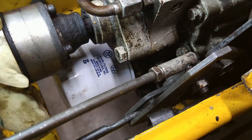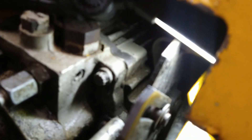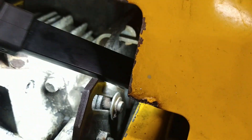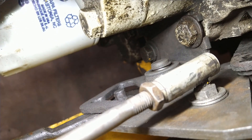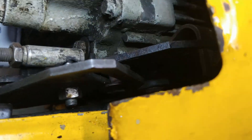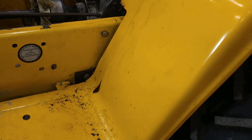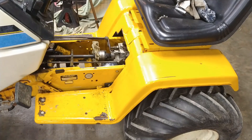Sometimes if this plate back here is not too worn, you can shim it. Same deal with this one — you can put some fine machine washers in there to help pull it tight against that snap ring so it doesn't have a chance to wobble side to side. And that one's so bad that we might have to replace that plate. But in order to get clear access to any of this, we've got to pull the fender pan off, so we'll pull the fender pan off and get an even better look at this whole assembly.